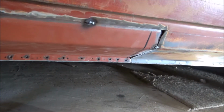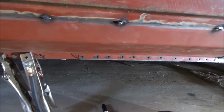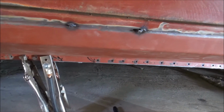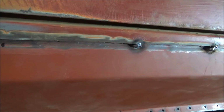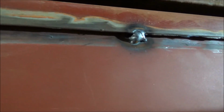I've messed up. It's kind of hard to see, but I've messed up with this piece. I'm going to have to go back to the drawing board and start again. A friend told me to lip the panel in so that they weld over a gap, but I lipped the wrong side. I lipped the panel, which means that I need to pull it out to hold it tight, and as soon as I started welding, the gap got way too large.